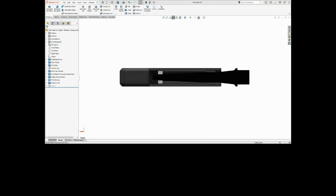If we look at a cross-section of this pedal, you can see how the bearing and the bushing both press fit in, and there's clearance for the spindle, as well as threads for the dust cap. Typically you don't want to print threads, but these aren't really loaded threads in this case, and they're not super critical. It just keeps dust out and helps retain the bearing. So we could get away with it in this case. They're fairly large threads as well. Typically I wouldn't recommend this, but there are some things we did to help mitigate chances of failure with this pedal as well.